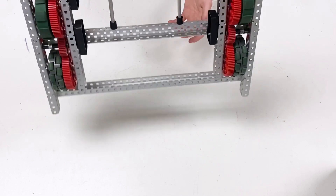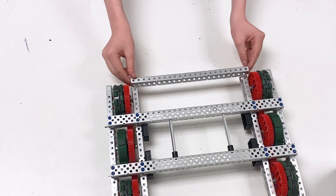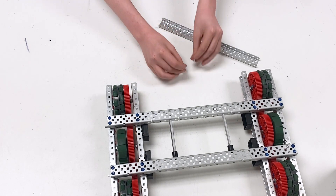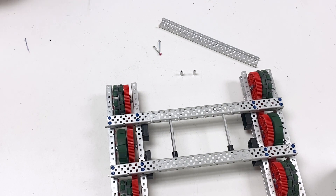Once that is done, we're going to turn this around and add the 123 to the back. This one is a bit more special because this is the connector to the flywheel, so we added some precautions. You're going to need two three-fourths inch standoffs, two 1.25 inch screws, and two three-eighths inch screws.